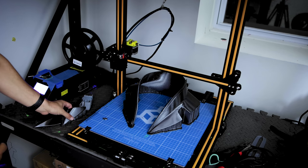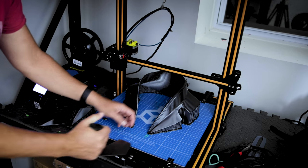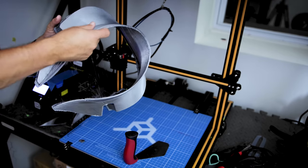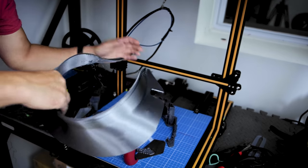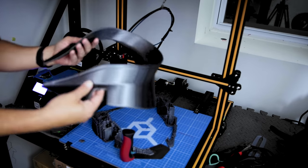This was a quick 27-hour print. I ended up having a print failure initially because of some support issues, and then while it was printing it snagged on one of the edges. I might reprint this all over again, because I'm a crazy person like that. But overall I think this printed really great — a 0.6 millimeter nozzle. Crazy how fast this printed. Loving it. The details are looking really crisp other than this big print issue with the layer skip where it looks like I didn't have my supports well enough under this one edge — but it's looking super cool.